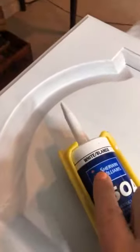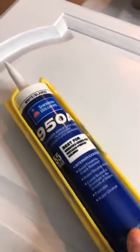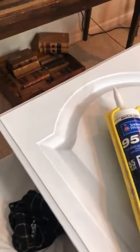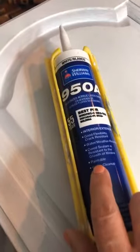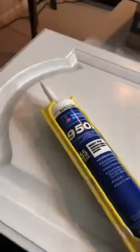So this is Sherwin Williams white caulking. And it's the main thing that I look for in my caulking, that it says paintable. And so right there is the word paintable. That's what you want. Have you ever done a bathroom or something where someone has caulked it and the caulking doesn't take the paint and you got to tear it all out? So you don't want that.